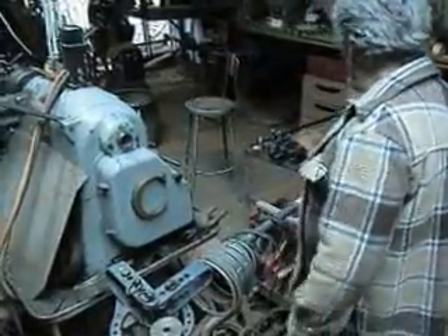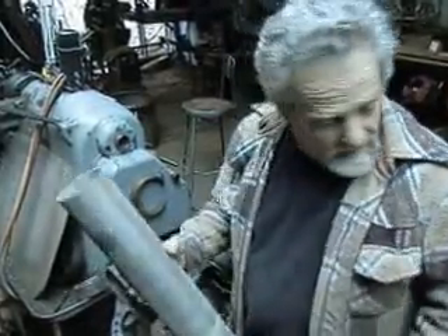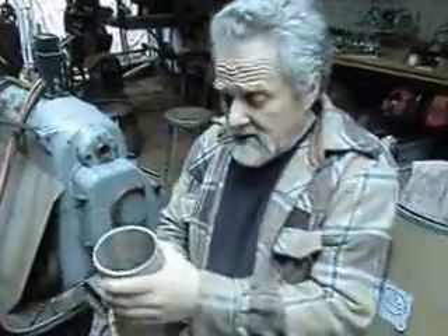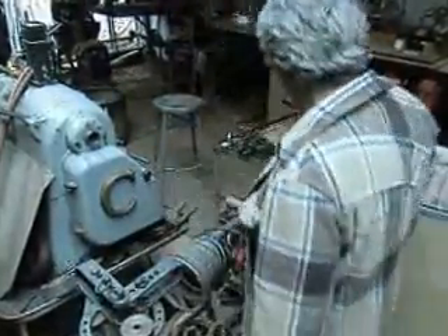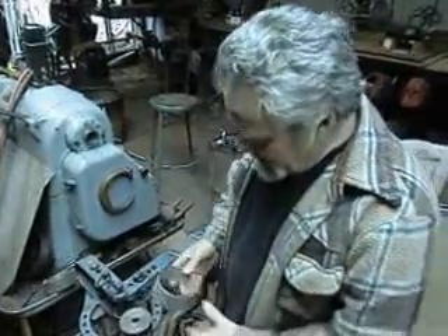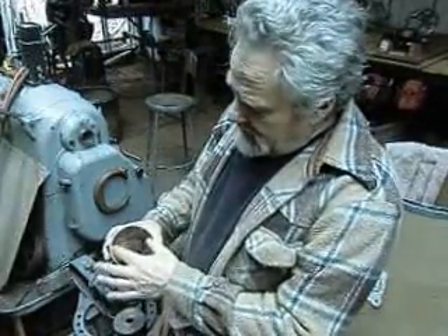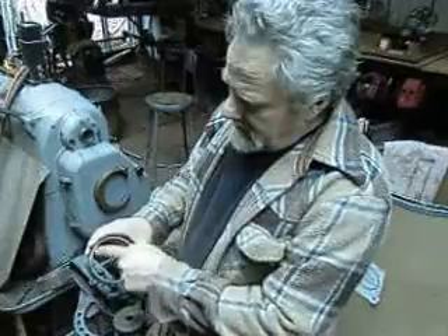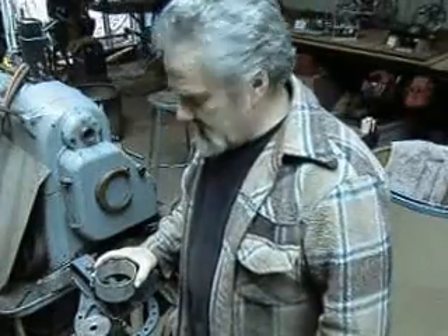What I did is I had this old piece of stainless laying around — and it's four inches — which is exactly the right size to form the metal to make the ring. So I cut a little chunk off here and it should fit right in there. We're going to do what we did about three weeks ago: put a center in there, put a couple of supports out here, and make ourselves a little T-cross with a hole through the center to act as the right-sized die.